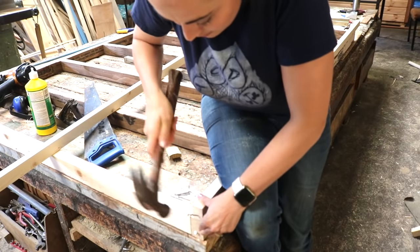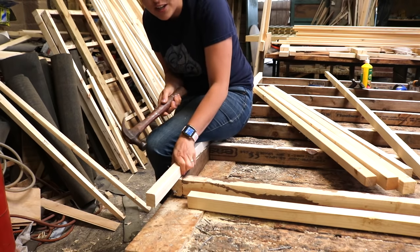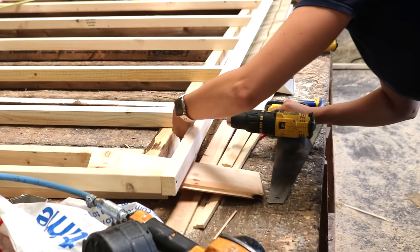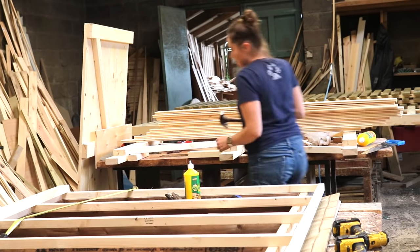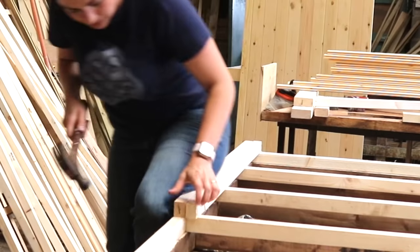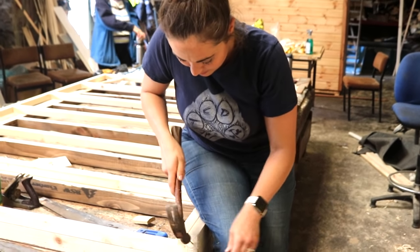Now I'm temporarily toenailing the bottom stud to a square frame underneath — but don't let whatever's underneath confuse you, the base underneath belongs to another shed that was in the middle of being built. Finally, I'm screwing all of those uprights between the top and bottom piece. For the next shed panel, it was the first sloping narrow frame. Because we've already got a square frame underneath on the table, we'll be nailing the first frame onto that so we don't have to keep checking everything for squareness all the time, and it saves space while you continue to build the rest of the panels on top.